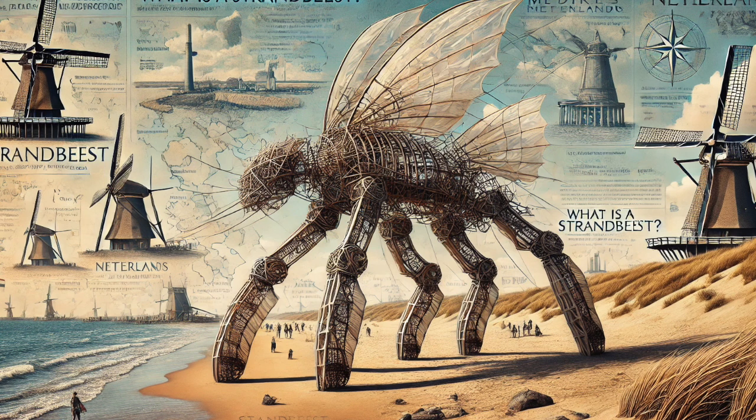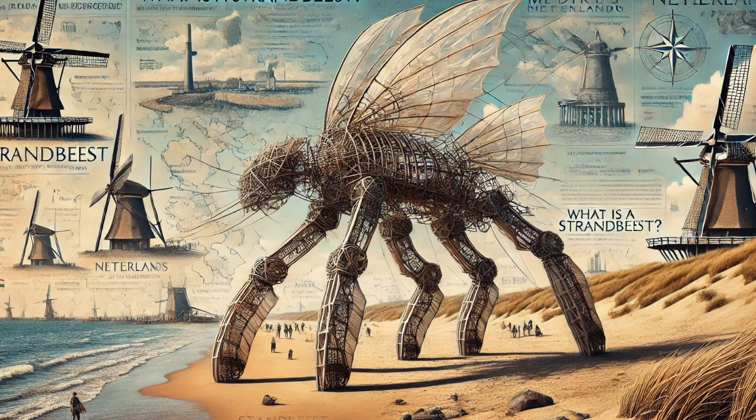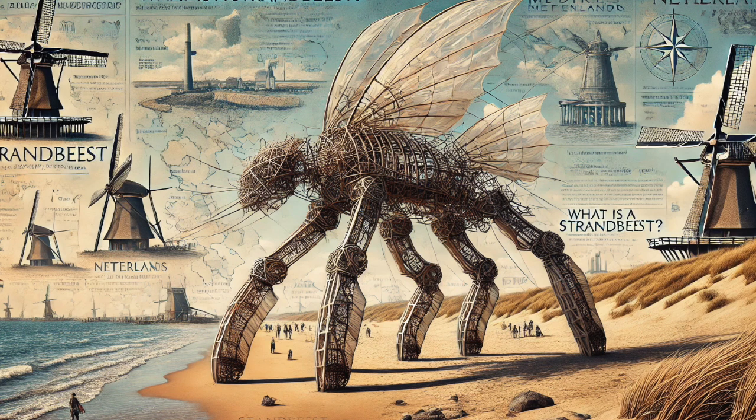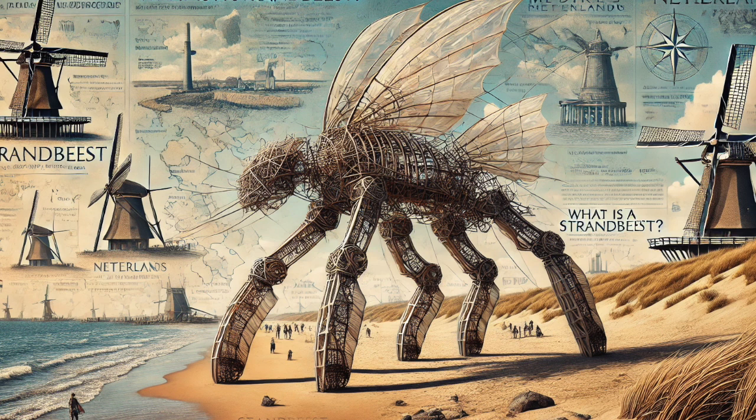The beach isn't just wind and salt spray — there's also that ever-shifting sand to contend with. He focused on the feet. He designed broad foot pads and flexible wire toes, which were specifically designed to prevent the Strandbeest from sinking into the sand. It was this combination of distributing weight over a larger area and allowing the feet to flex and conform to that uneven terrain — like giving them snowshoes on the sand. It goes back to that idea of observing nature, looking for inspiration in the way animals adapt to their environments.